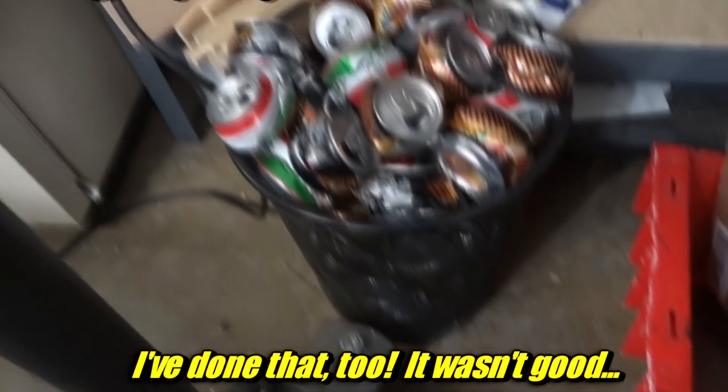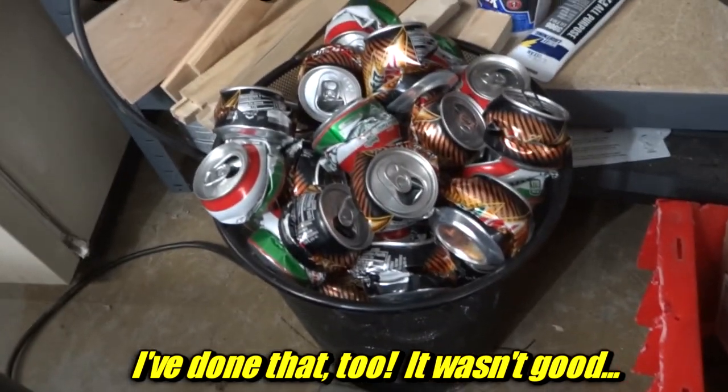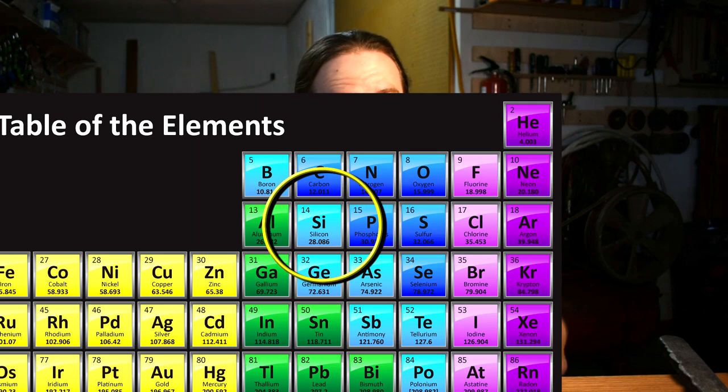This is why previously I said, don't use cans for casting, that's true. Use something that's already been cast. So use cast aluminum for casting, that will save you. And the reason there is, for casting, you want silicon. Silicon allows them to flow better. It does the same to a bunch of other metals. Cast iron has silicon in it, along with carbon. Silicon bronze flows really well because of the silicon added to the copper. Alloys designed for doing casting do better when you use them for casting. It should be obvious, right?